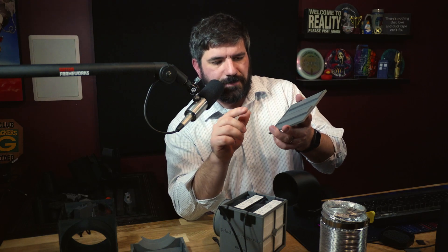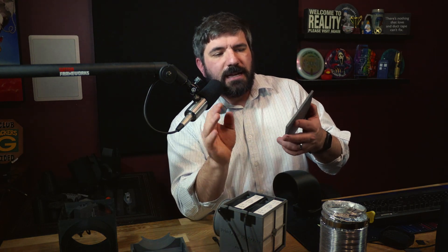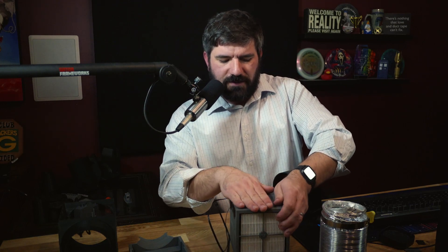There's also a separate file for the lid, which has bump-outs — it's directional. These bump-outs go over the fans to help keep them in place, block air, and force it through the filter rather than around it. It just snaps right on. The tolerances are pretty tight so it's okay if you have to force it — but do not glue it on, because you will at some point need to change the filter.